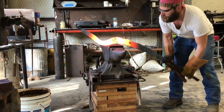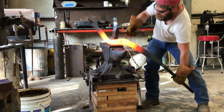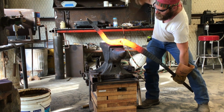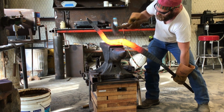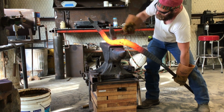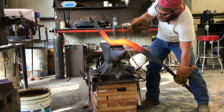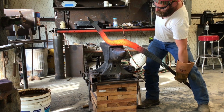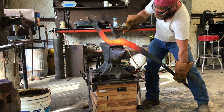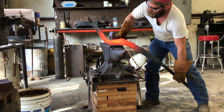Another thing that I need to make sure I do is keep that raised flat area an actual raised flat area. Since we're going to have 6 bars running through this Damascus billet, we want them to run with each one of those spikes and with that raised flat area and taper off. That's why we're forging this thing to shape. It'd look funny if I ground out all of those areas and then you see the bars disappear because I ground them out.